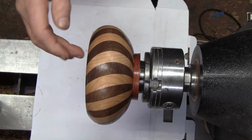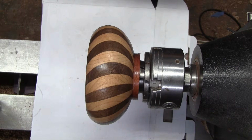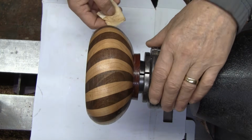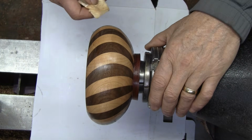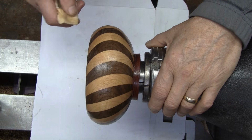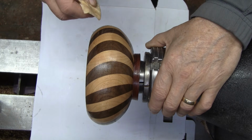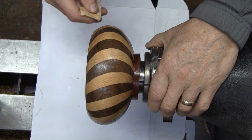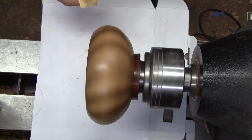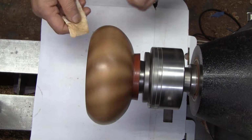I ended up getting 5 coats of lacquer on this, and I've just wiped some abrasive paste on it. I'm going to go ahead and work this in and then polish it. I recently did a video on how I use abrasive paste and polish, so if you want to see the exact steps that I do, I'll put a link in the description for that. But I'll go ahead and get this polished, and I'll be right back and show you what we ended up with.